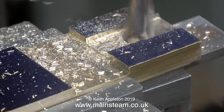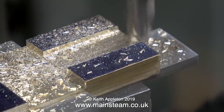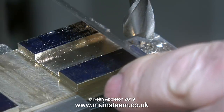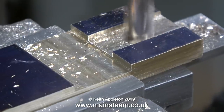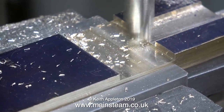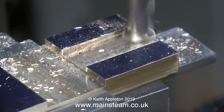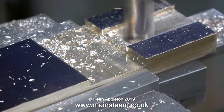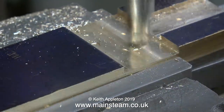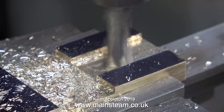I'm using the slot drill from the last episode which takes quite deep cuts and is still very sharp. I need to leave an equal amount intact at each side. The dimensions are not critical — it's just to give some clearance for the flywheel to revolve — but it wouldn't look very good if each side was a different size. On the corners of these thick side pieces, which I haven't touched with the milling cutter, are where I'm going to drill the holes to mount the main engine on some kind of baseboard.